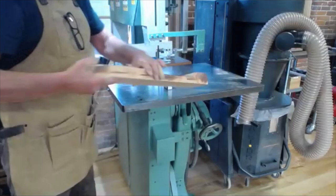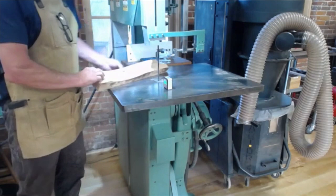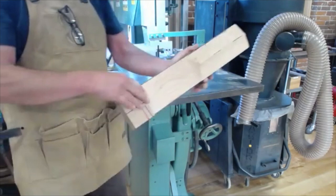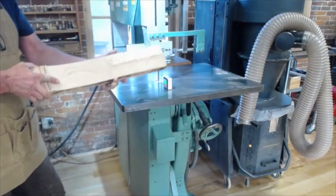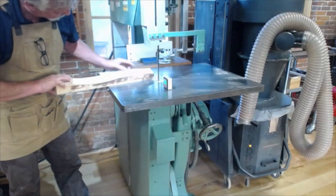And then what I do is I cut out the bowl of the seat, or the bowl of the saddle. It should be close to the same thickness on this side, but I only do from 9 inches back because I want this to be the pommel. Okay, I hope everybody's following that. So I bandsaw this here, and then I cut from here to the center line of the board. And this is a tricky cut because I'm riding on the edge of the bevel.